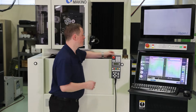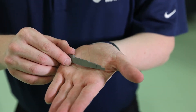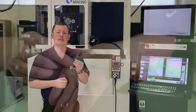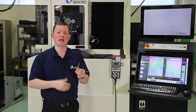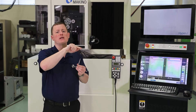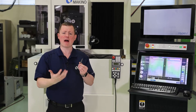I have an example here for you. A shape like this — long and slender — when you machine it, if there are any internal stresses in the material, the shape wants to move after that rough cut. Then when you get to subsequent machining, second and third passes, your speeds are going to be extremely slow on one side and very fast on the other, and you may get a section that doesn't clean up after the rough cut.